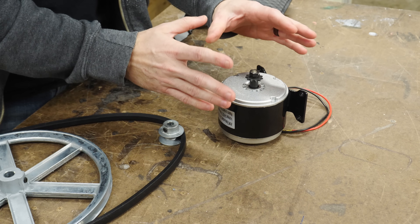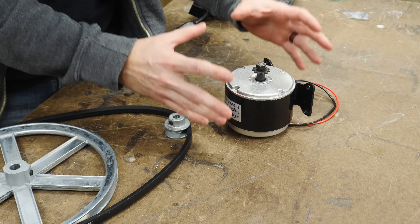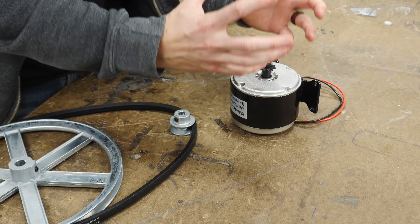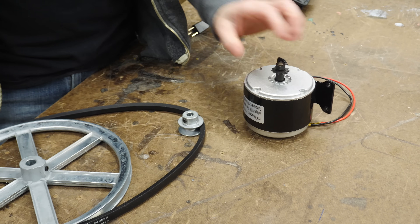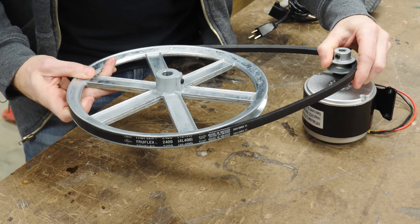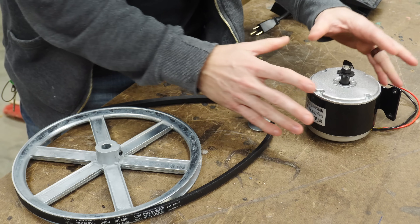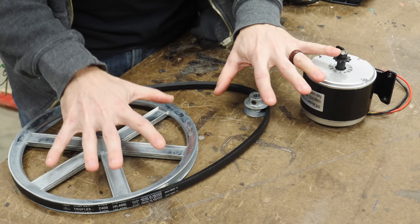I don't know a whole lot about pottery wheels, so I've done a little bit of research and found out a few things about the motor. You have to have a relatively low RPM motor — you don't want it to go too fast, but it does have to have a lot of torque, because you're pushing down on top of it plus you have the weight of the clay. So we've got a motor that's higher RPM than we want, but we're gonna slow it down using some pulleys — two flywheels with a belt in between them — and this should ratio it down to the right RPM. I've got a speed controller coming so we can slow it down even more, but in the meantime let's go ahead and mount all this stuff to the plate.